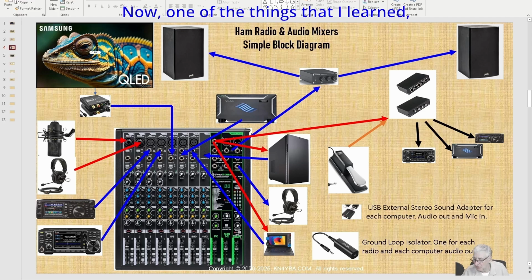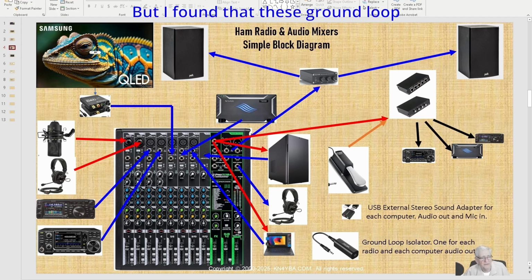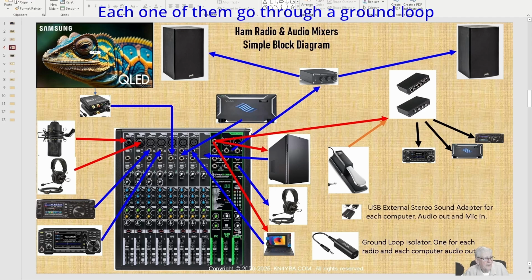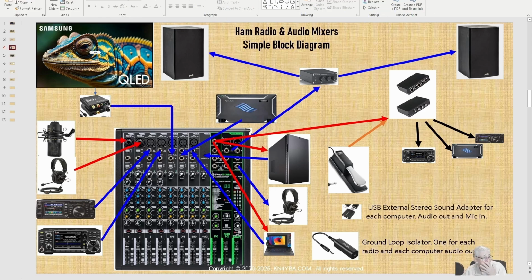Now, one of the things that I learned, you can build all kinds of stuff out there, but I found that these ground loop isolators are outstanding. They'll fix a lot of problems you have. They don't compromise on the audio quality. They're relatively cheap. I'll have a link in the description below. Of course, I get them from Amazon. I've got one hooked up to each audio output. Each one of them goes through a ground loop isolator just to make sure I don't get any ground loop noise. And it just clears it up, and I have not had one problem.